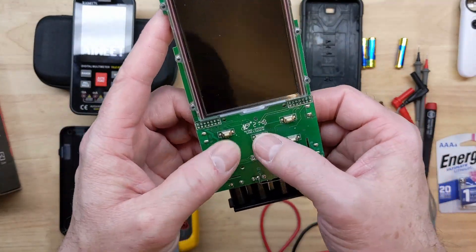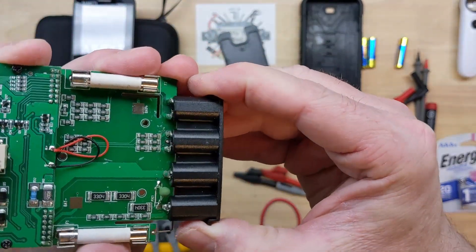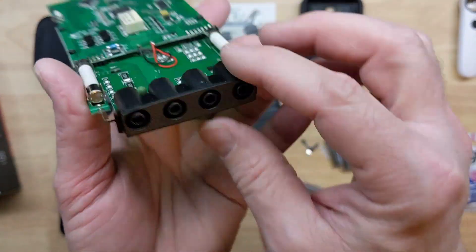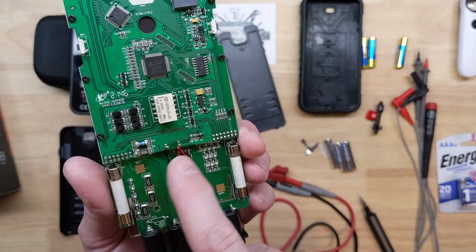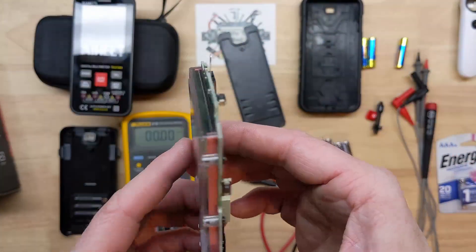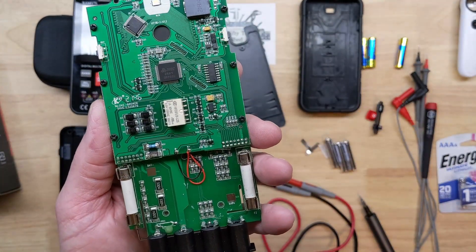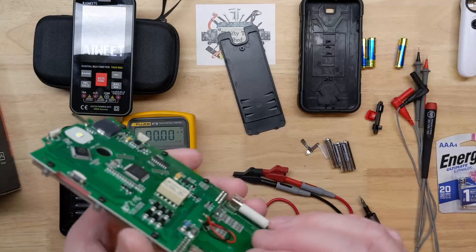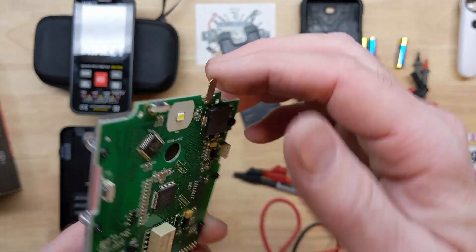The push buttons feel really good. Taking a closer look at the jack and the way it's split on the current jack itself. We have HRC fuses, a voltage divider, and a PTC. I don't see any MOVs — no MOVs on a category four meter, which surprised me, but they're getting by with these components. Overall the board quality is very nice.